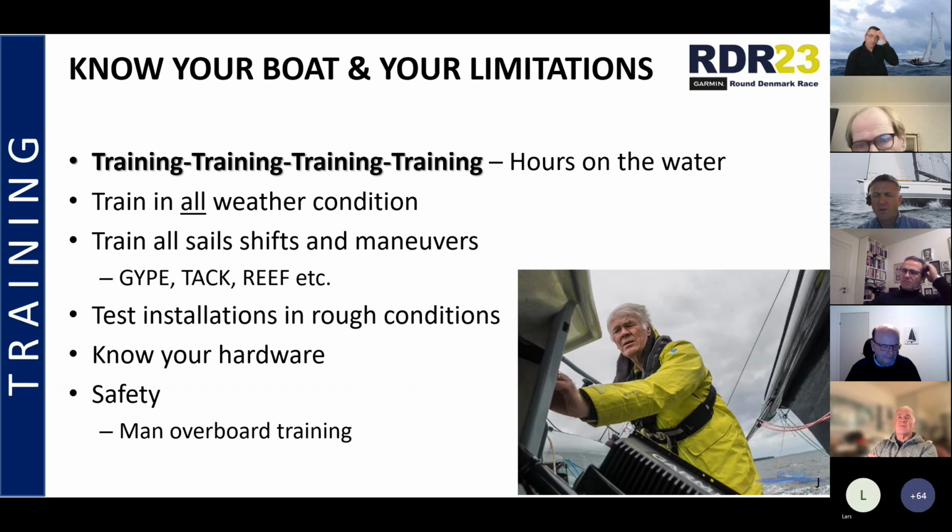Most of the good pilots have an adjustment where they adjust the rudder movements against how fast the boat is going. On lighter boats you can actually imagine that the speedo comes out of the water, and then the autopilot thinks the boat is going very slow, and it adjusts the rudder very abruptly. So that's the kind of thing you have to consider, where to get your speed input from when the weather gets rough. You can get it from the speedo, you can get it from the GPS.